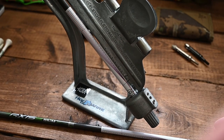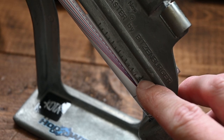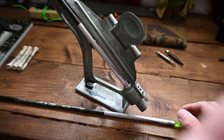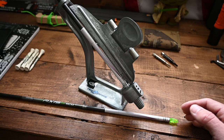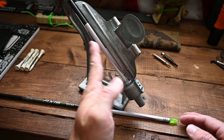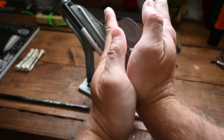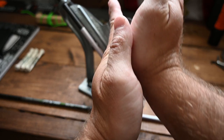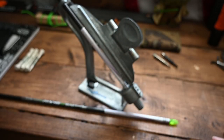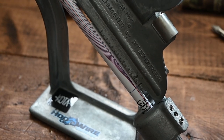Just now the corner of that vane is sitting squarely on that crosshair. The purpose of this tool is just for determining the angle of your vanes — it doesn't matter if that crosshair is exactly where your vanes would normally go. Imagine my hand is that center line: here is my vane angle. It doesn't matter where on that center line the vane is, because that doesn't change what the angle is. We're just using this tool to determine the angle.